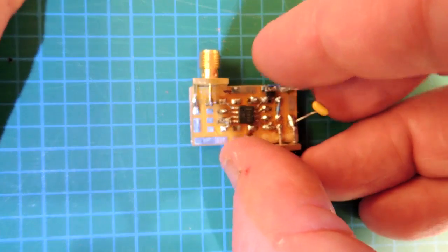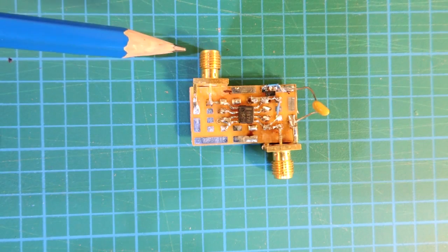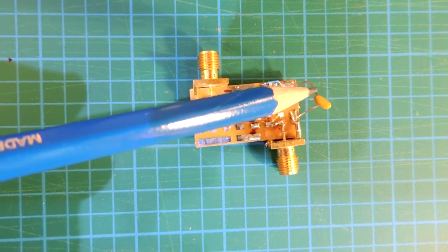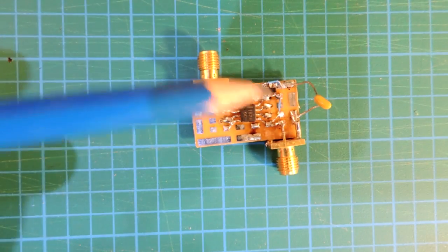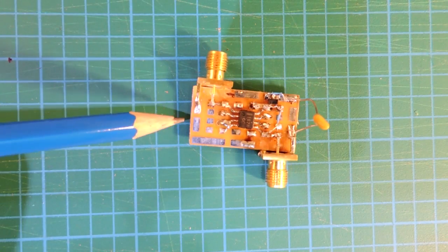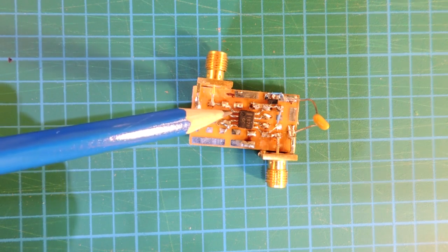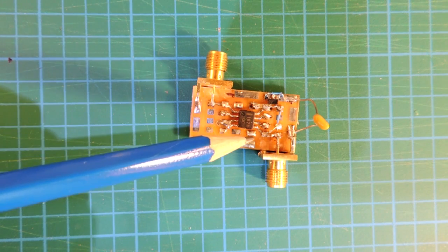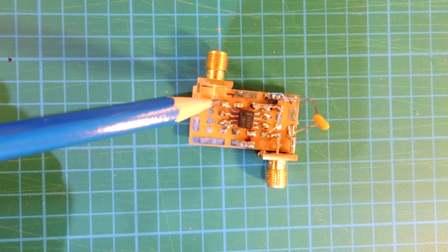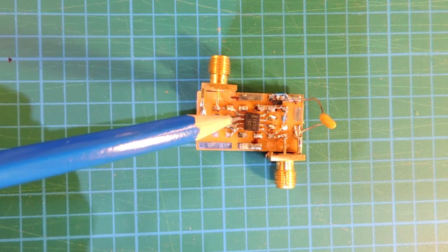Here's a picture of the finished circuit board. There's an SMA input on one side and SMA output on the other side. This capacitor hanging off is just bulk decoupling to connect to a power supply — it doesn't need to worry about lead length. The things that do have very very short paths. I've soldered from the input through a capacitor directly into the IC, and the same thing going out — as short as possible. I'm still going to need to shield these, but now I've got a much more realistic chance of doing so.